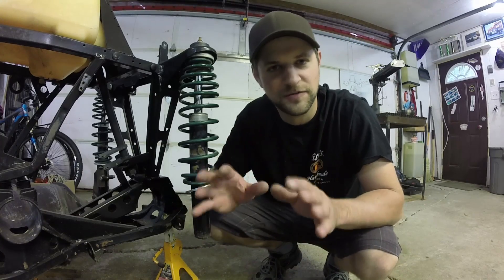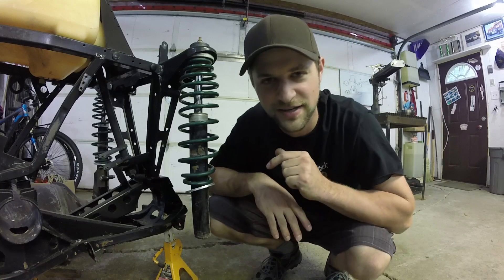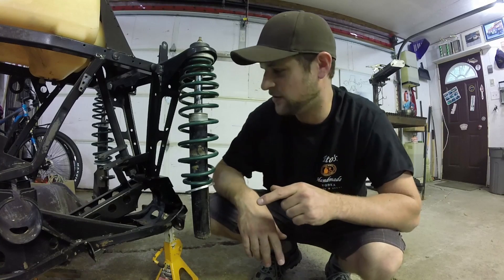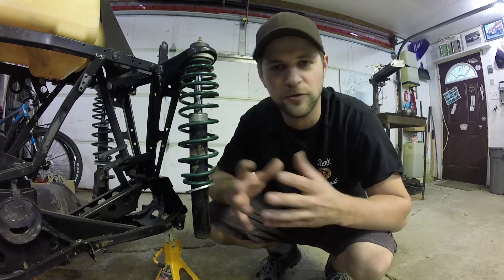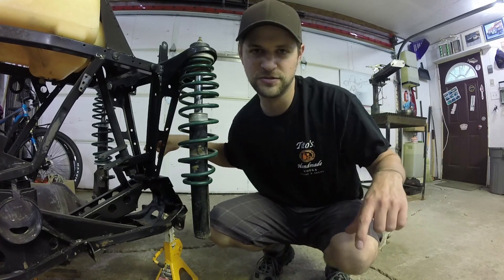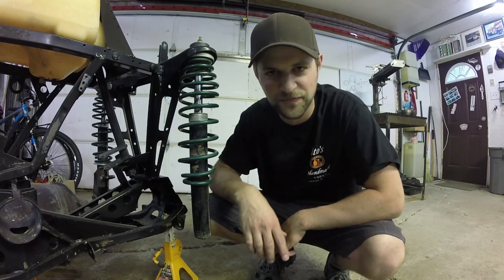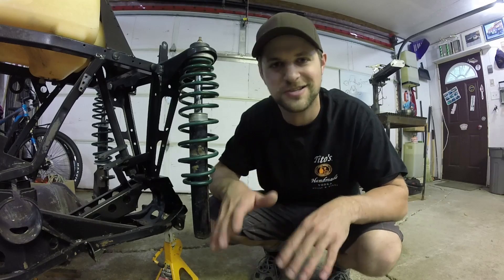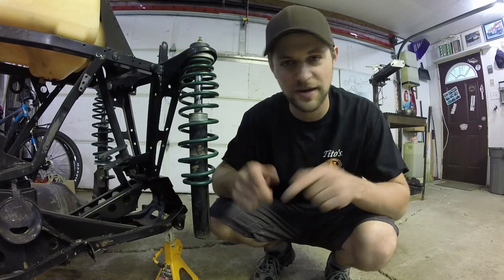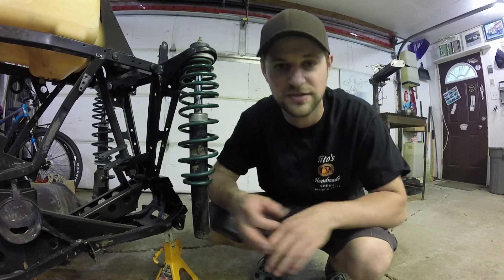While doing these mounts, I finally figured out the front suspension — I couldn't be happier. I'm done with the tractor articulating setup. Instead, like an off-road rock crawler, I'm going to build a four-link for the front. That's going to support an axle running between the two screws. The screws are going to act as the bottom links, and I'll have a triangulated top link on top of the axle. It may sound like gibberish, but I'm just going to start building it — it's going to work great with up-and-down movement and articulation.